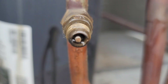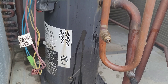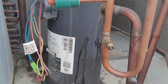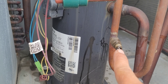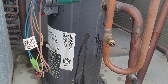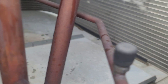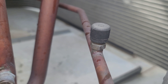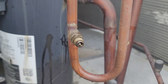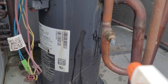If you look at the stem, the core stem is threaded. This type of Schrader valve, once disturbed — like when you hook up gauges — the valve core starts leaking. The smaller Schrader valves on the liquid line are fine; you can tighten or replace the core. But this type, once they start leaking, they keep leaking.